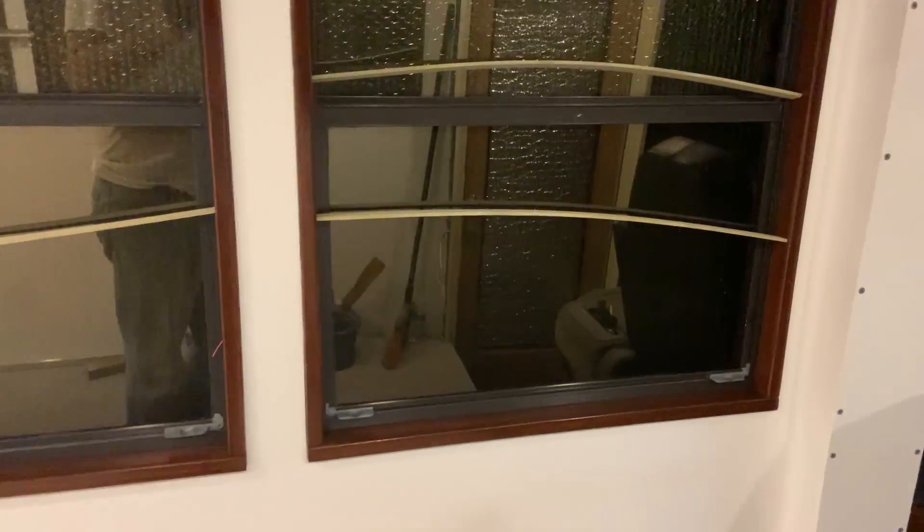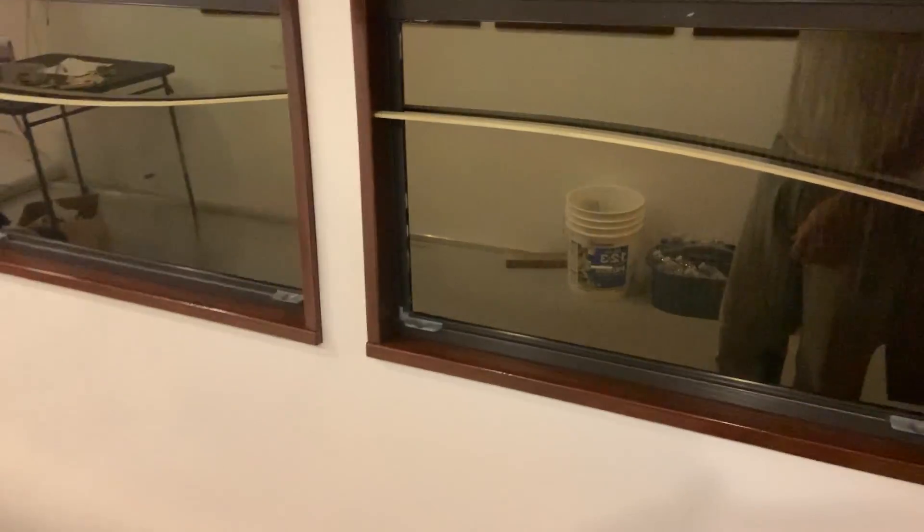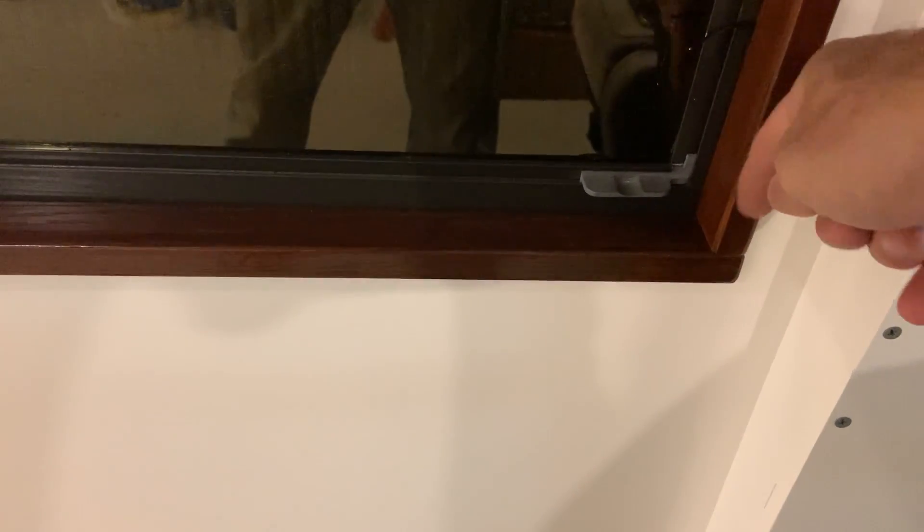It's Wednesday January 13 and the windows are done. What I did is I put a screw in here from the top — I pre-drilled with a 9/64ths drill bit. I happen to have some really long ones, like a foot long, so I could get up in there really well without the drill motor hitting anything. Then I pulled it out and drilled it with a 3/16 hole from the bottom side so that the alignment would be right.